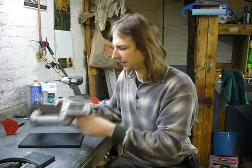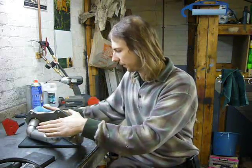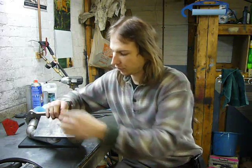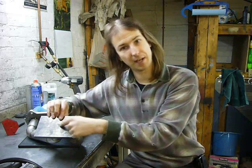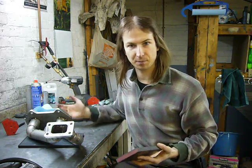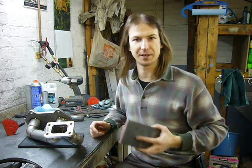Now my plan is to close both ends of the manifold off with those two plates, and on the top plate, just drill a hole and feed the argon in via a tube, and then on the bottom plate, drill two matching holes to allow the oxygen to slowly flow out. This is the first time I've back purged something, so we'll see how that plan works.